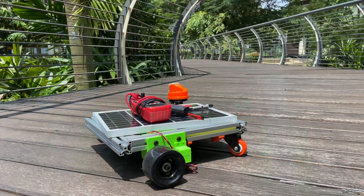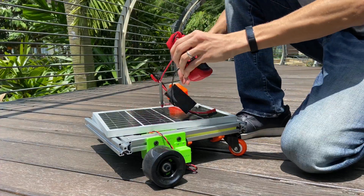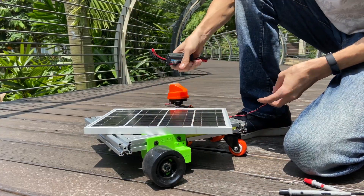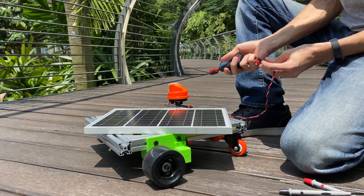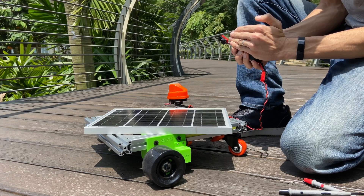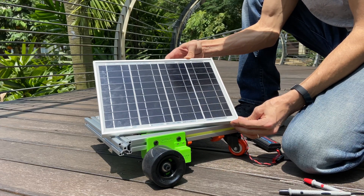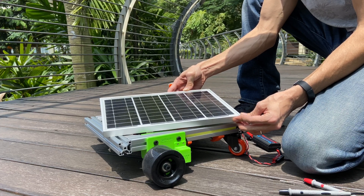Let's take it outside. The sun just came out right as I was coming down here, so this is good. Let's see how many volts we get without any load. It's warm — this is nice. Put this on the source side. The meter says 21.7 volts. And if we crank this up towards the sun — now the clouds are coming out — 21.1 volts.